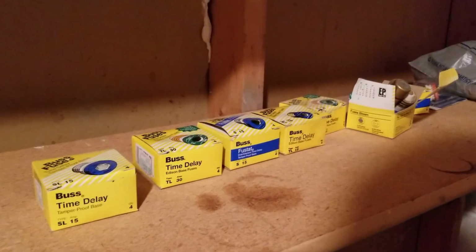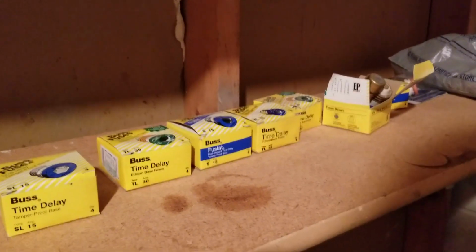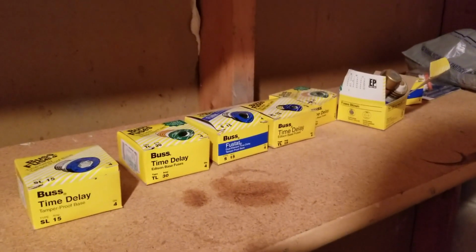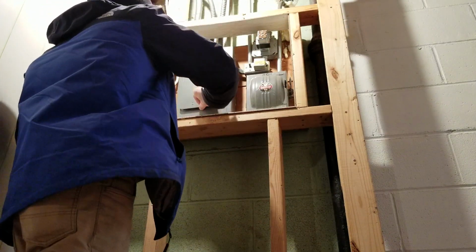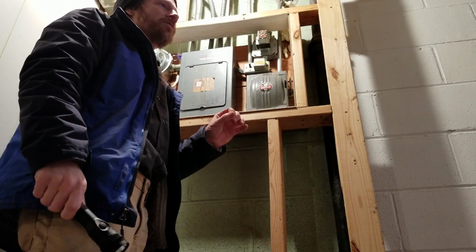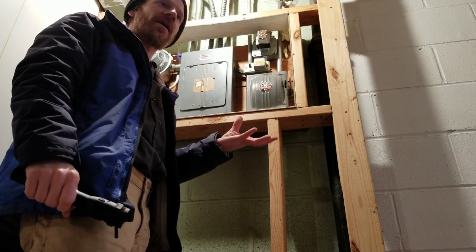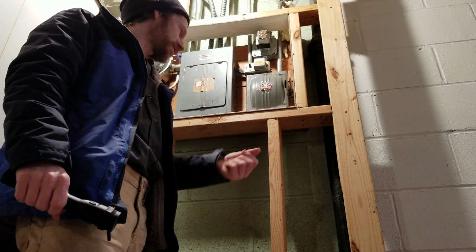It's not the same as with a breaker panel. You just go into the basement or garage or wherever your panel is and you just flip it back on. You actually have to put in a new fuse. So you just want to make sure that for a fuse panel, it's all set up so that the homeowner will not have a chance to put something in there that shouldn't be in there. Otherwise, that's where you lead to a fire hazard. If the wire overheats, it could melt and then your house burns down.